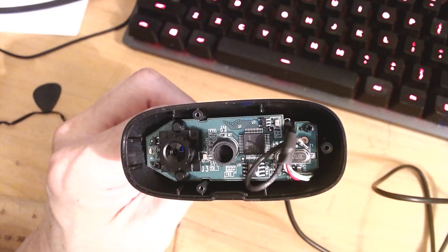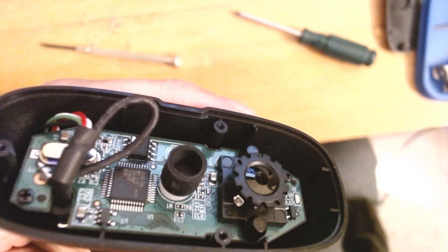And then you get straight into the circuitry, and it's very simple. What you see on the left is the lens — it's got a little sprocket or barrel, a lens barrel, which was absolutely fascinating when I saw it. The circular thing in the middle is actually the microphone. For it to work, what we really need to do — and I flipped the webcam over — is find the little bit of hot glue that is holding the lens barrel in place. They must have an optimal distance, probably around three feet, a yard. They set the lens into focus, and once it reaches that focus at three feet, they drop a little bead of hot glue to fix it in place.